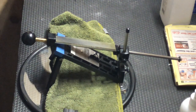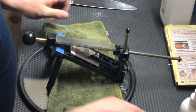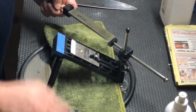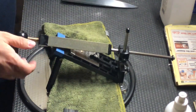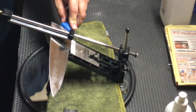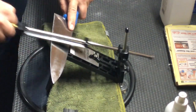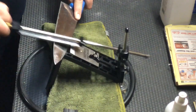Making good progress here. Now you don't want to take this 80 grit all the way to the edge, all the way to the apex. It's so aggressive you'll put some pretty good chips in the apex of the blade if you take it that far — you kind of want to stop before you get to that point. A Sharpie marker is your best friend when you're finding your angle and seeing how far down the bevel you're going. I'm just going to keep going on each side until I get it to the point where I want it to be.